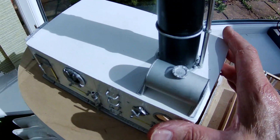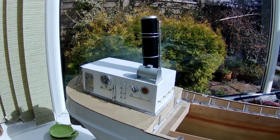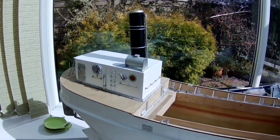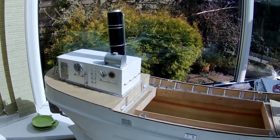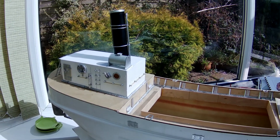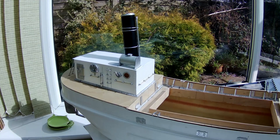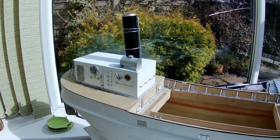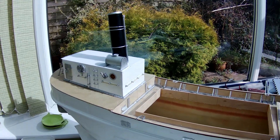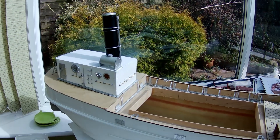This is the funnel. The reason they were called puffers is because they made a puffing sound originally when they first started plying their trade in the Crinan Canal area and on the Clyde — that was freshwater. Very soon they realized they could sail out into the Western Isles, which was saltwater. The water was originally taken from the canal for the steam engine — it wasn't a condensing engine. So later, they fitted a condensing unit to reuse the water and keep the boiler in good condition, because if you put salt water into a boiler it wouldn't last very long. That's why they used to make this puffing sound — the steam used to come into the funnel, rather like a steam locomotive.